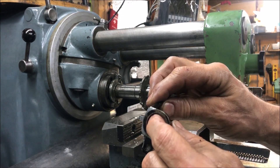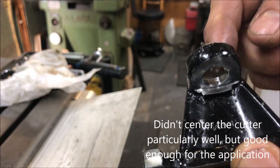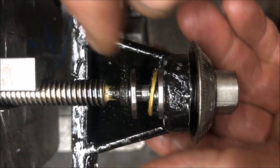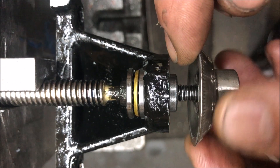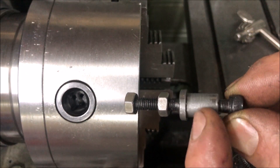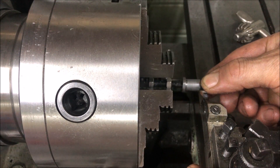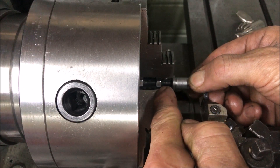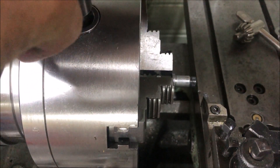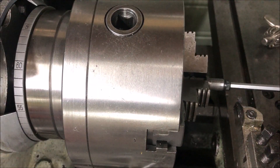So a simple job — seating for the ball bearing here. My versions will come out a little bit different, but I have a thrust washer back here, and then a sleeve with a neck here. Not much of a trick really, but to point out — when I'm turning these smaller pieces, diameters that are a little bit fiddly to mount in the chuck, I use in this case just an arbor made out of a bolt, and then a couple of nuts. Then mount this assembly in the chuck jaws, snug it up so that the piece mounts to the face of the chuck jaws, and then just tighten the bolt afterwards. And it's ready to be turned.